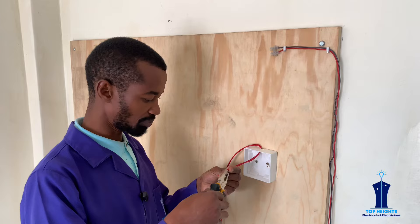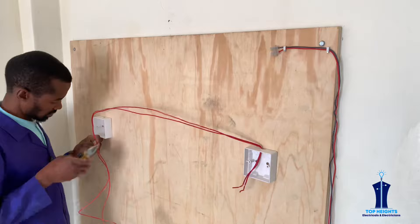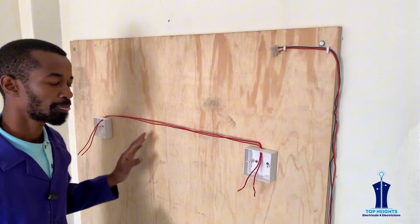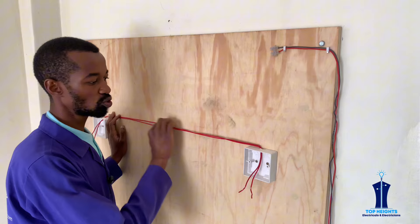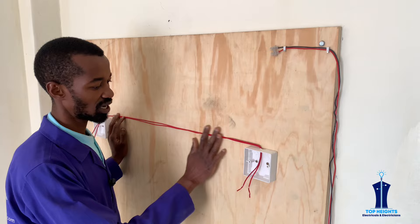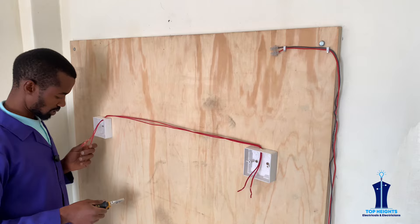Now because this is a demo, surface wiring should be done on pipes, or if it is somewhere visible and you want it to look good, it should be done in trunking. For the purposes of demonstration I've done it just like that, but it should be trunked or in conduit. On this other end we just double-mark like that.